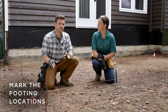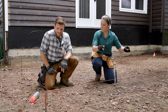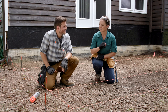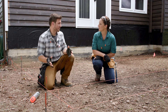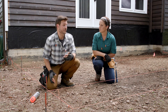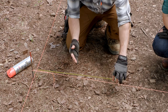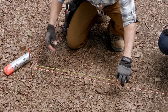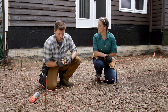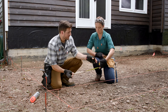Now that we've marked the location of our beams with these strings, here's a recap of everything we've accomplished so far: we've squared up the sides with the house, marked our beam locations, and done all that to get to this point of marking our footing locations. Our first post is going to be right here, but according to our plans, we have a cantilever of the beam one foot past our post. So we're going to measure one foot away from the edge of our deck frame, and we want to be at the center of the post — in our case, that's 14 and three-quarter inches.